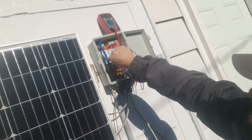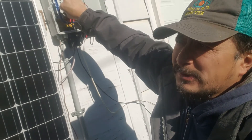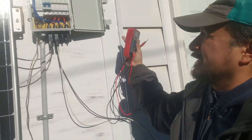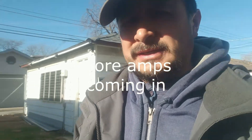Put my second string into the combiner box. Now I can flip the combiner box on. Testing it — it's at 62 volts coming in. Don't forget, I've got a 48-volt system and I ran these in parallel. So it's 62 volts coming in. If I had run everything in series, it would have been too much — I would have stepped up all the voltage. This way I get almost the same voltage but more watts coming in.